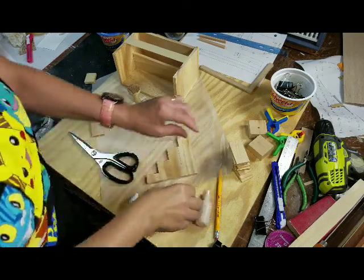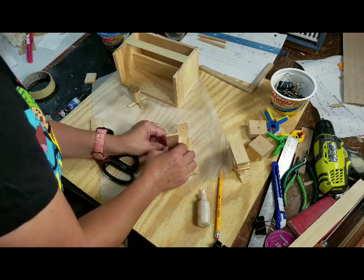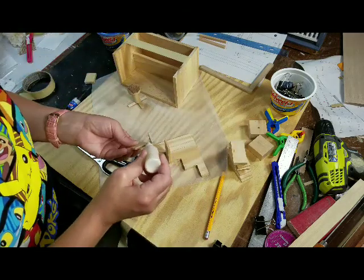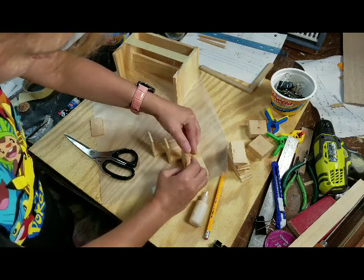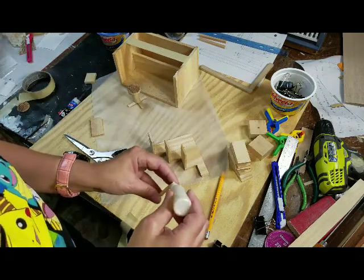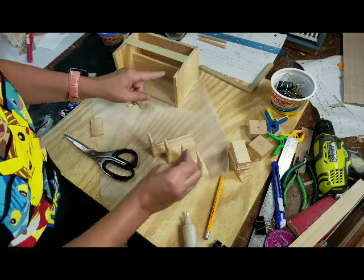For the steps, you're going to take your step support pieces and glue them in place on the front of each one of these bases, making sure they're even with the top and even with the front. For this piece of wood I'm just using a paint stick because they're thin enough, but you can use one-eighth inch bass wood. This is one-quarter inch oak, and you don't have to use oak — you can use pine. I just used it because I bought it a long time ago and it was on sale. You can use whatever you want as long as it's quarter inch.